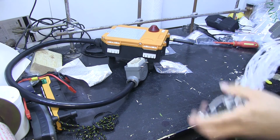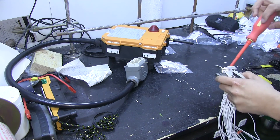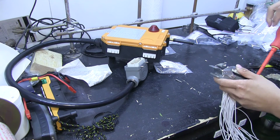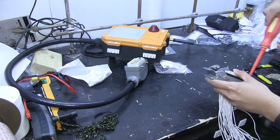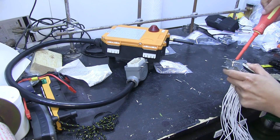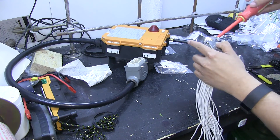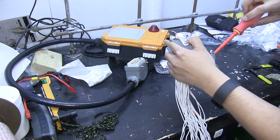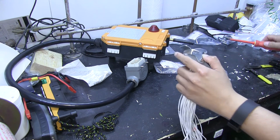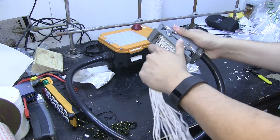Once you have both sides fully prepared, all you have to do is use the included M3 screws — captive fasteners with the insert — to connect the insert onto the housing, and you're done. To recap: these connectors are mechanically robust, waterproof, and have electrical current carrying capacity of either 10 or 16 amps. You have the ability to customize them with an insert for the number of connections you require, as well as a housing in the footprint you have available. Choose them if they fit your needs.